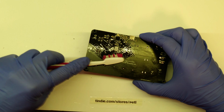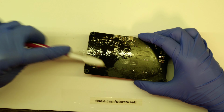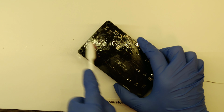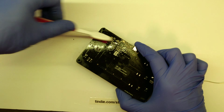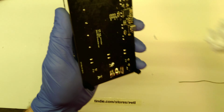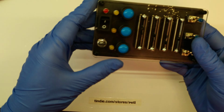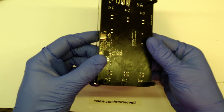relaxed with these things. So what I can see now is, I'm not sure if the solder joint over here is looking too nice. I'm quite sure that I want to rethink this, but let's first clean it a bit more and then take a look. Yeah, probably a bit more solder. The rest on here I'm going to wipe off. Now the unit should look like this, which is quite nice. A bit sticky still, but I don't want to use too much of the IPA.